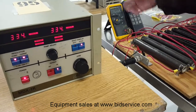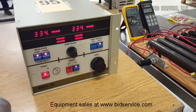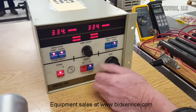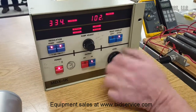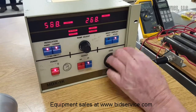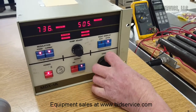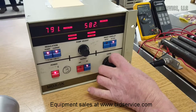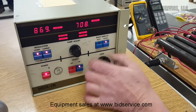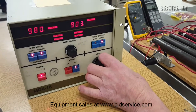At 100 watts, that's about 334 volts. Our meter shows 339 — that's very good. We're still very cool. Believe it or not, the temperature will be identical on every single one of these resistors if you were to measure them. We'll go back to our wattage: 200, 300, 400, 500, 600, 700, 800, 900.